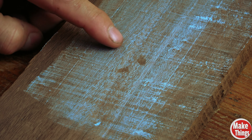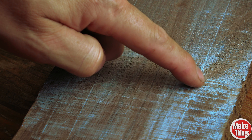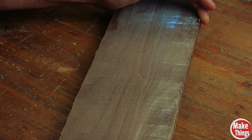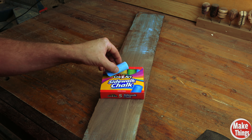After adding the chalk, check for gouges, divots, planer and jointer snipe, blade cuts, cross grain scratches, and any other difficult-to-see errors waiting to surprise you later on. When you're done, use tack cloth, high grit sandpaper, or even an air hose to blow it off. You can get a box of these surprise eliminators for a few dollars and they're long lasting.